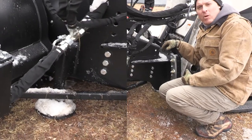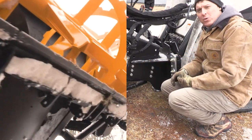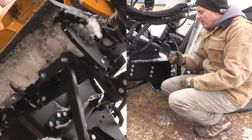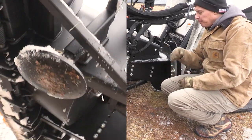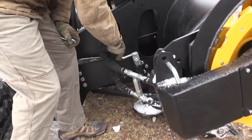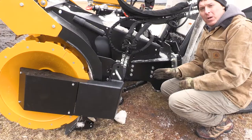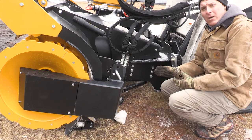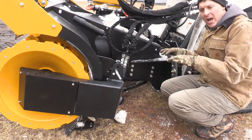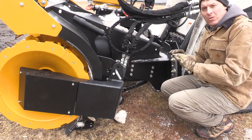On the backside of the snowblower, we use two skid shoes that are very large — about nine inches in diameter, roughly the size of a dinner plate. They pivot and are on the bottom of a threaded rod so they can be easily adjusted from the top, giving a fine adjustment that's easy to lock in place. Skid shoes are important on a snowblower — that's how you determine how much down pressure you have on the cutting edge. You can also rock it fore and aft on those skid shoes on the fly if you want to change whether you're scraping or not scraping.